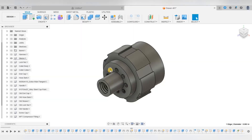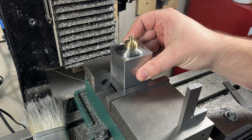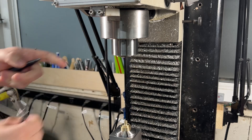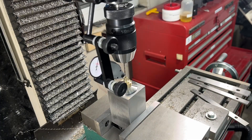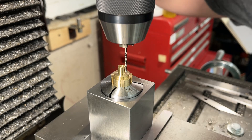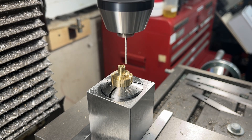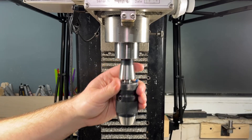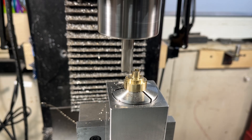Finally I can part the sleeve off using a Q-tip handle to catch it so it doesn't fall and get ruined. But the part isn't done yet — I still need to machine these 8 holes that will allow air to pass from the end cap through the sleeve and inside the barrel. Using the square 5C collet block I can mount the sleeve back into the mill, this time mounting it vertically. I use a dial indicator to tram the collet block, making sure it is perfectly in line with the z-axis of the mill. Next I need to locate the mill on top of the stem using an indicator clamped to the spindle to find the center of the threaded stem. Using a 1/16 inch drill I start to drill the 8 holes, being very careful when starting each hole. It is then a simple matter of going around the stem, moving the drill to each hole location and drilling out the remaining holes. There is a little burr left on the stem from parting, so I swap my drill chuck for a 3/8 inch end mill and do a quick skim pass to remove the burr.